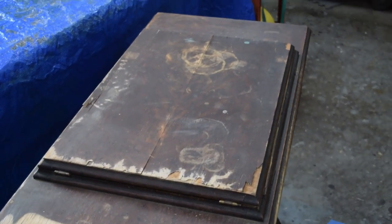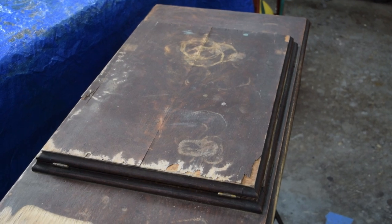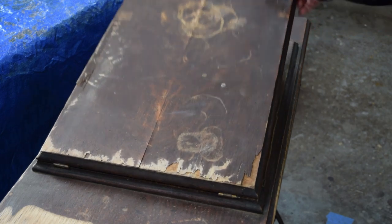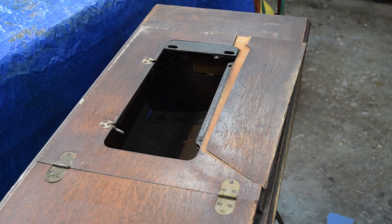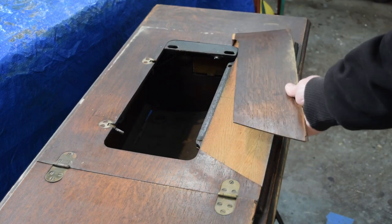And just like many of these machines that we see, this one's suffering from the typical issues with the veneer, which both comes loose and pretty much just disintegrates. And as we open the top, you can see the veneer that is inside the machine cabinet has come loose, it's missing. And there's quite a sizable dent right here.